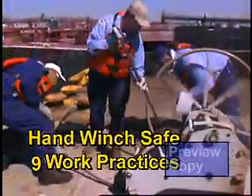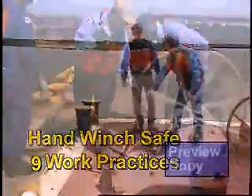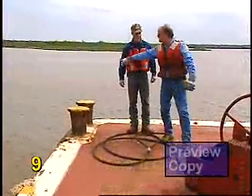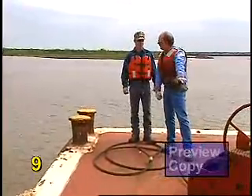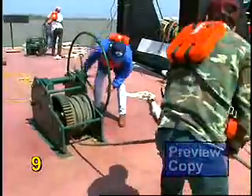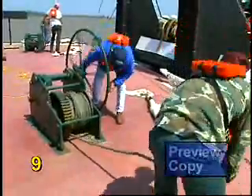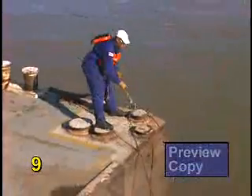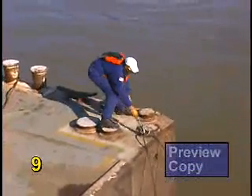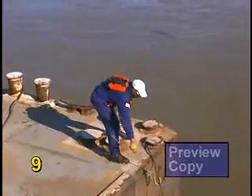The following safe work practices are critical to avoid injuries during winch operations. For a winch to safely apply the needed tension to wire or synthetic rope, it must be used correctly. Wire rope and lines must be monitored so that the correct amount of tension is being applied. Too little or too much tension can result in a coupling wire breaking. When tension is applied or removed from the cable and rope, the potential for injury increases if shortcuts are taken.